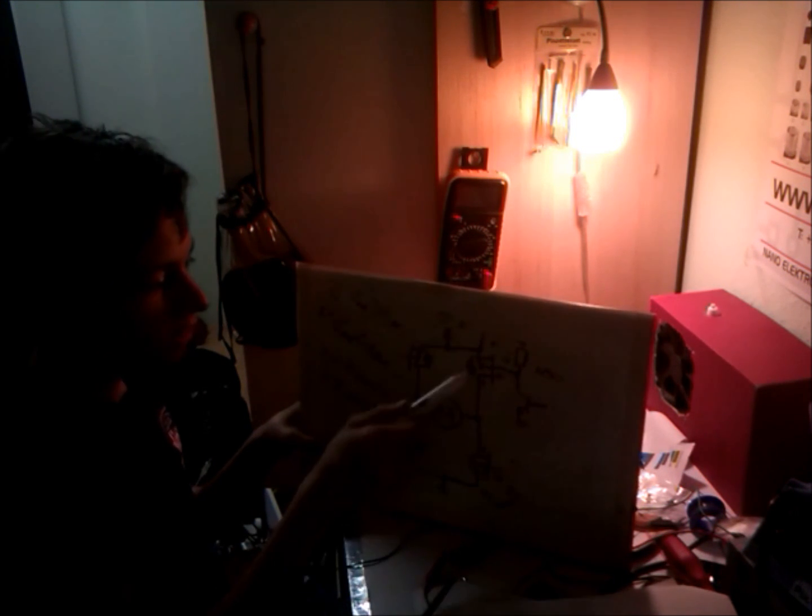So this is one thing people many times do wrong about these MOSFETs. If you drive this directly on 5 volts level, and let's say you got 12 amps, it's actually 12 volts, sorry, talking crazy, it's late as I said, then this MOSFET is going to be activated the whole time. And once you activate this bottom MOSFET in combination with this already activated MOSFET, and you actually want just this one to be activated, they're both activated, and what happens is that there comes a short, everything starts heating up, and you can potentially burn your circuit. So that's bad.